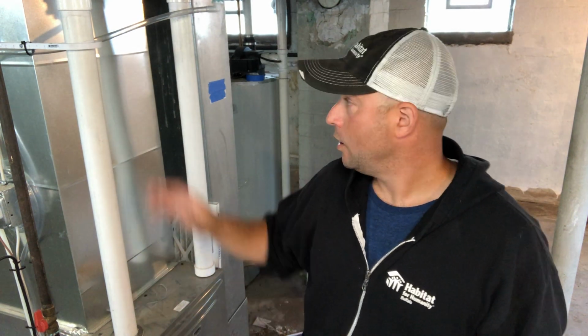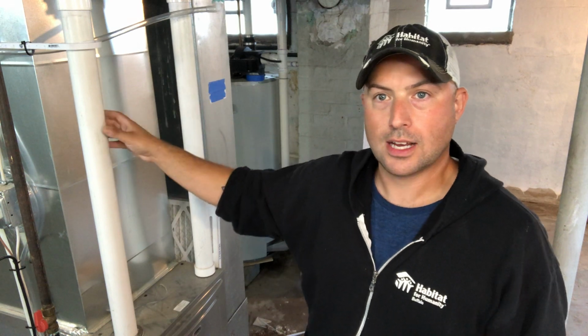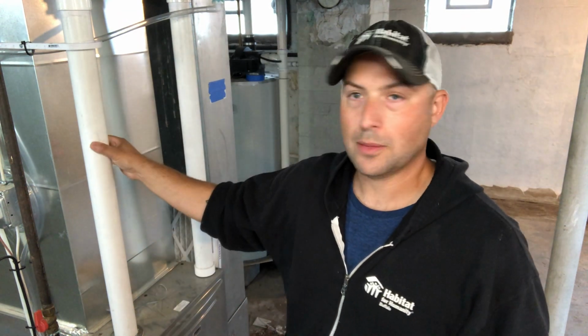So a few additional tips and pointers for keeping your heating system as efficient as possible and getting the longest life out of it that you can. There's a few things. So first of all, like I said before, make sure you're changing your filter regularly. We have these 2 intake and exhaust pipes that go to the outside of the house. Those will be pointed out to Habitat homeowners when you do your walkthrough, but you can typically find them. They're right next to each other, and they're 2-inch PVC, which is just white plastic.